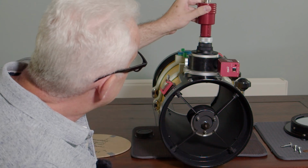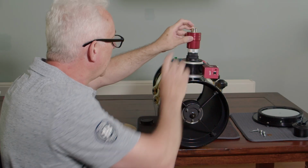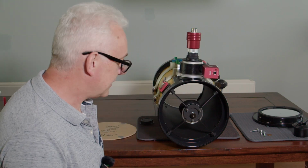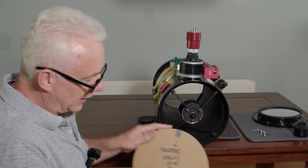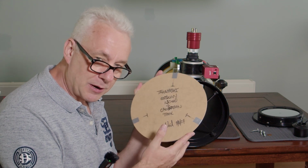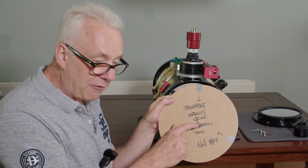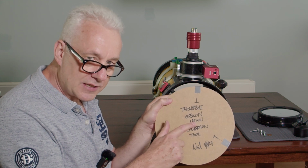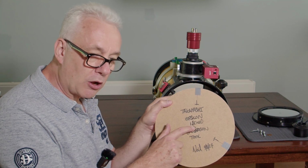Now we're going to place that inside the Epsilon in the eyepiece holder. There we go. I'm going to turn it on. Now, as you can see, or maybe you can't see, not at the moment at least, that doesn't benefit us at all, right? Now, we bring our special tool in. Remember, I told you about the special tool? Now we're going to place this where the primary mirror cell should be, and we're going to try to adjust the secondary. Our first coarse adjustment, let's say, is to get that laser passing through the hole that's in the center of this disc. That's our first step in this process to recollimate this telescope.